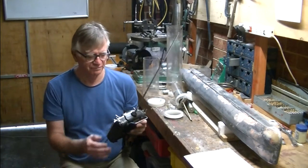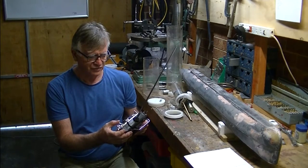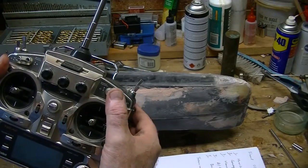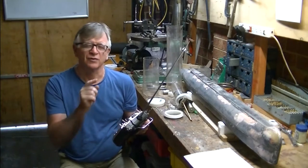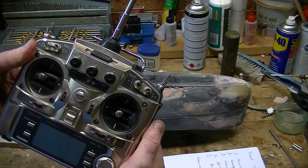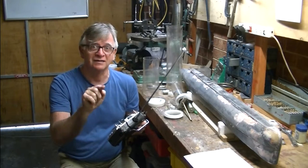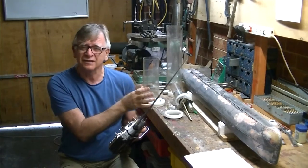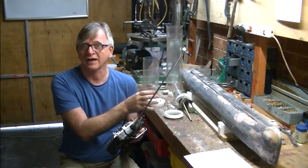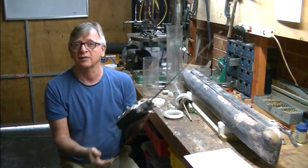Now we come to the automatic controls. I've got two more channels that I'm going to use with the two-way switches. The way that's going to work is this: when I pull the switch this way and then back, the boat is taking a snapshot of the pressure at the depth that it's at, and it will remember it. When I push the switch forward, it will go into depth-keeping mode. What that means is that the bow hydroplane will then work to keep the boat at that depth — at the pressure that it remembered. And the piston inside will adjust if the boat's getting higher or lower. So it's a fairly crude system — one second every eight seconds — it'll just make a slight adjustment to keep the boat on track. That's my depth-keeping control.